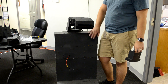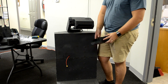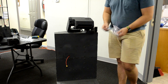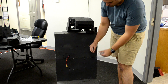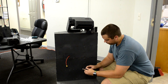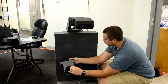We have a full robot here — head with camera, base, all of that. All we need to do is put the arm on and we'll be good to go. This odd-looking piece is what mounts to the torso. We'll feed the wires through here and take some screws to mount it. The screws you need are the finely-threaded ones — about this size, six of them. They are not the coarse ones. You'll need the included screwdriver bit. Feed the wires through and pull them all the way through.